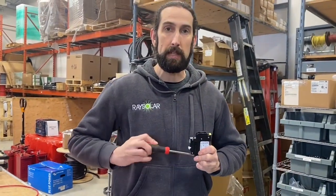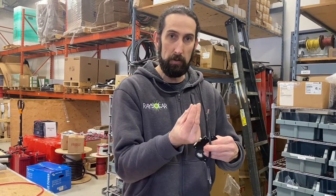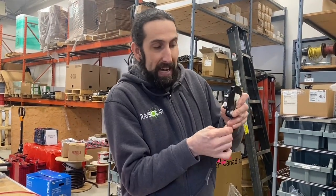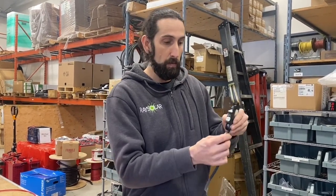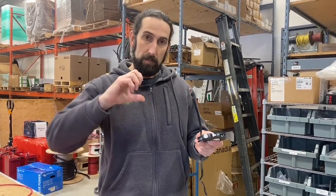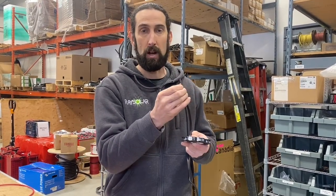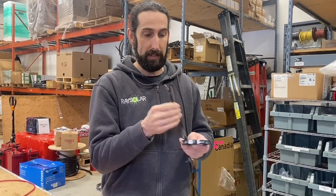One would ask: how come it didn't fail right off the hop when they tested the equipment? What happened was the wire was tight enough inside the box — when it came through the knockout connector or strain relief, it was pushing up tight against the breaker, making it look like it was taut and screwed down. But after a few months, on this output breaker carrying almost 50 amps, it started to build heat because it was loose. We know that torquing your mechanical device — on a breaker or a lug — is critically important to ensure good mechanical contact and avoid gaps. Otherwise you create hot spots where current builds up and causes failure.